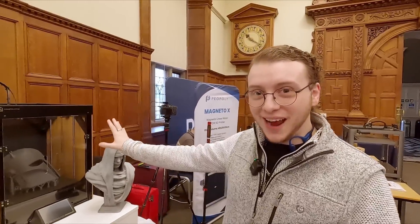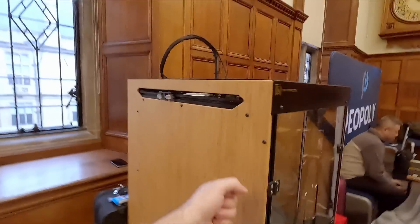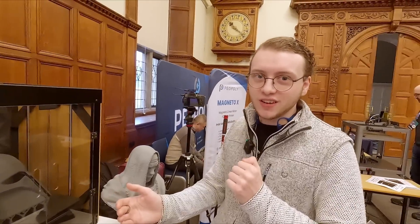The wood is actually accidental. Why wood on a printer — this isn't like an old Ultimaker made out of laser-cut MDF; this is somewhat rigid wood. Why not acrylic or ACM? For very particular reasons. We are focused primarily on performance, not aesthetics — it just so happens it looks good. For vibration absorption, you want a fibrous material. Plastic and metal transfer energy rather than absorb it, so they're not ideal for larger or higher-speed printers without beefing up the frame, which costs a lot more. We did a load of research and the best material turns out to be MDF.